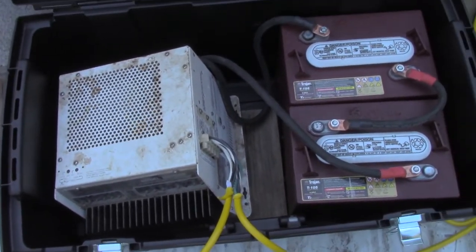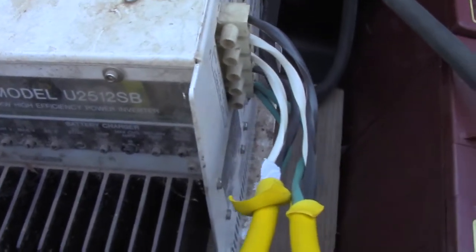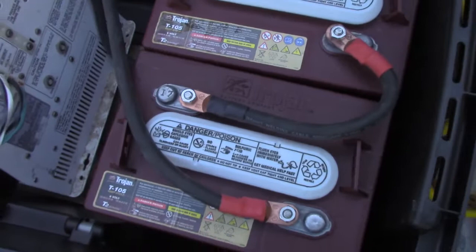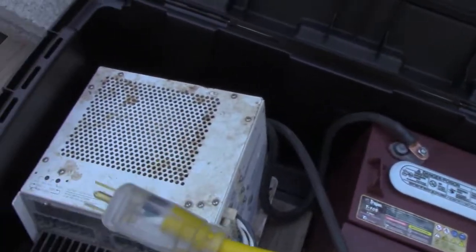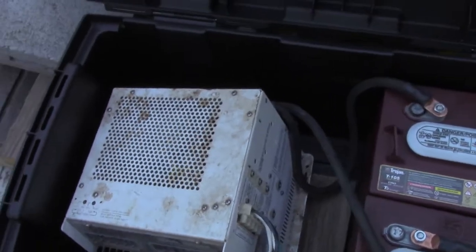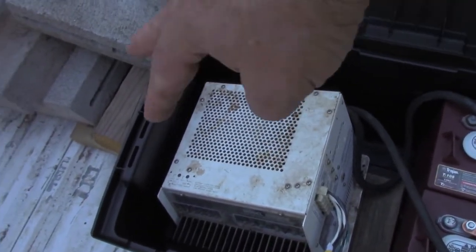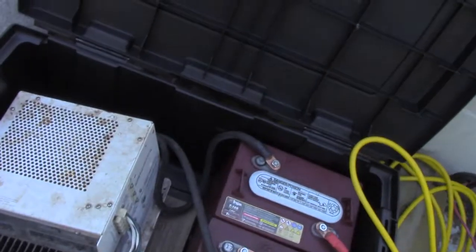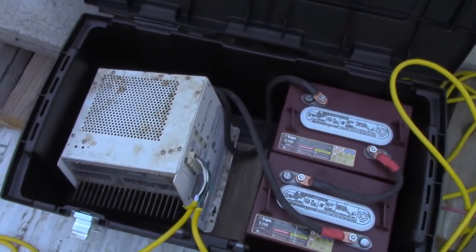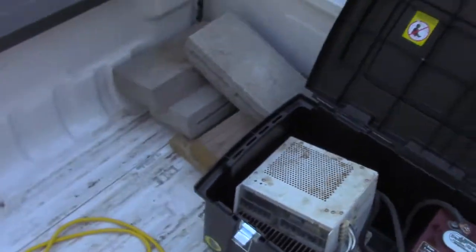It's the standby model — a U2512 SB, SB meaning standby. That means it's got a relay in it, and that's where the other half of the power cord went. I can plug it into the power pole, plug it in at the house, plug it into my generator — whatever I need. It will charge the batteries, and at the same time it switches in the relay and powers the loads directly off the AC. So the inverter is not working at that point; it's just working as a battery charger. The generator carries the load while also charging the batteries.